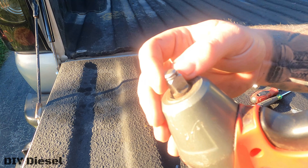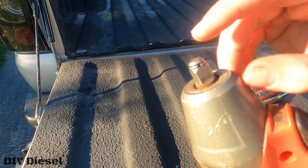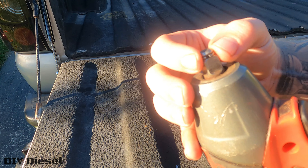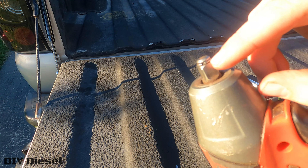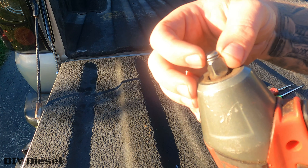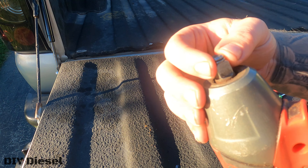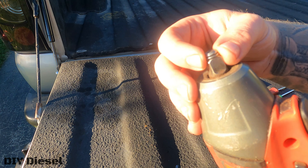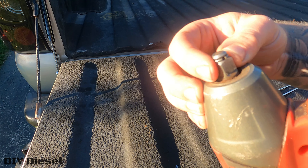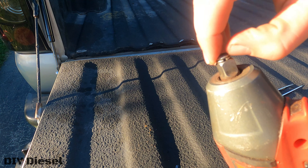If you see here, this is the ring that we're going to be replacing. There's two rings actually — there's the retainer ring, and then below it is an O-ring. What happens is when that O-ring behind it is destroyed, this no longer can have the right amount of friction, and it wiggles too much. Then it starts to wear too much on one side, then the other side, and the whole assembly just turns into junk.